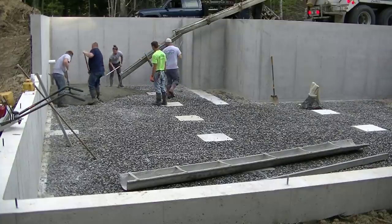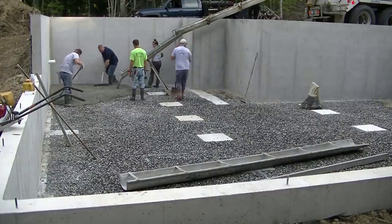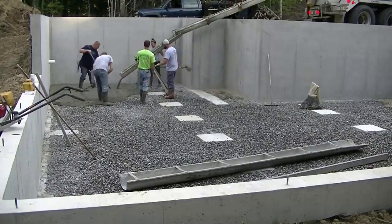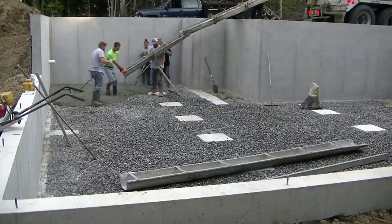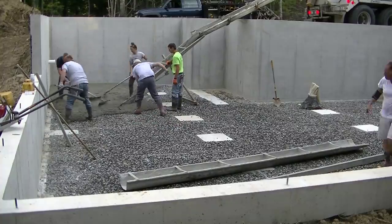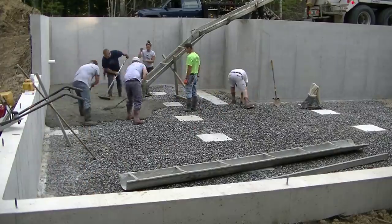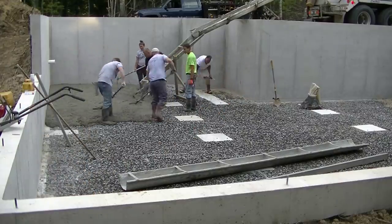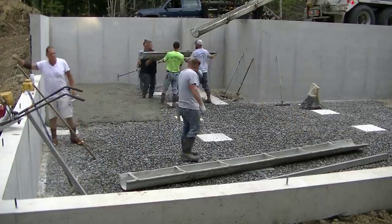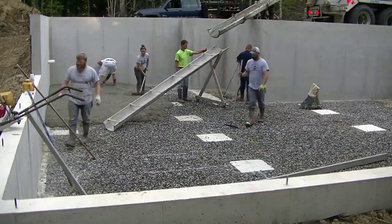So what we're doing — we live in Maine, and in Maine we have a lot of freeze and thaw cycles. Most of the homes built in Maine have concrete foundations, and the footings on these walls will be four feet below finish grade level on the outside of the house. The frost in the ground doesn't usually go below four feet, so these walls will never move and the house will never move in the winter. We get to pour a lot of these concrete floors inside basements — probably a hundred of them a year.